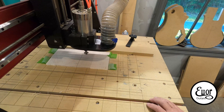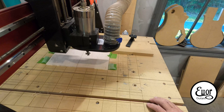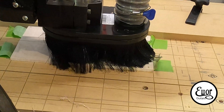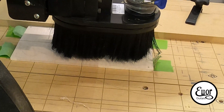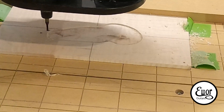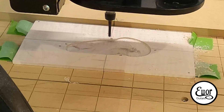The first thing I'm going to do is clear out the center section. You can see I'm doing the air pass right now just to make sure it wasn't going to go haywire like it did on the back of the guitar body. The blade switch needs an inch and three-eighths of clearance inside this body. Part of making that clearance is I had to recess this quarter-inch thick control cavity cover — I recessed it one-eighth of an inch. I left the perimeter a quarter inch thick, which is thick enough for the magnets, and I thinned down the center to one-eighth of an inch, which is going to allow that blade switch to fit in there with room to get the wires hooked on.